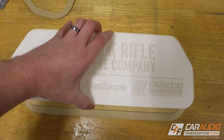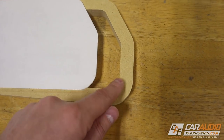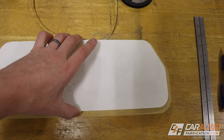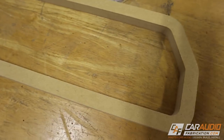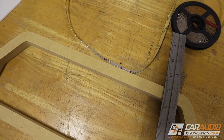What do we need to do to the inner piece to get our acrylic to fit in? We want our acrylic to load in from the back, so I need to make some sort of notch on the inside for clearance — not only for the acrylic but also enough clearance for my LED strand to fit between the acrylic and the edge of the wood. I measured and I can see that's about a half inch of clearance needed for the acrylic. Then measuring my LED lights, it's about another sixteenth of an inch. So a half inch plus a sixteenth is nine sixteenths that I need to cut in.